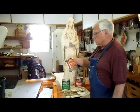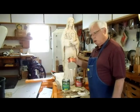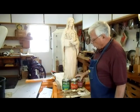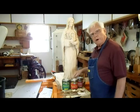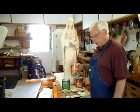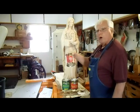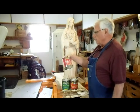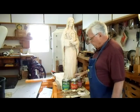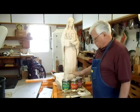And the stain is a Danish teak stain, but I'm cutting the stain, 6 parts of the top coat with 1 part of the stain. The color is right, but the hue is a little bit too intense. Before I put on the stain, I'm using a pre-stain, which is a wood conditioner. All these are oil-based products.